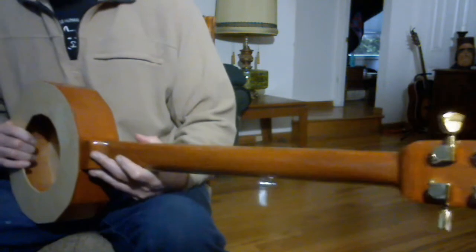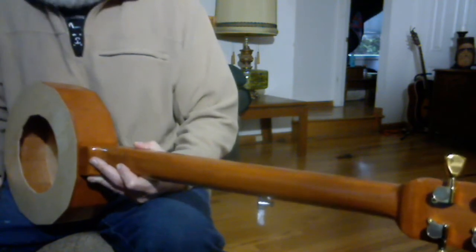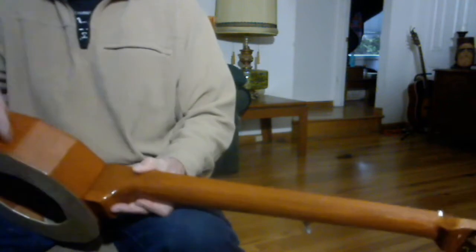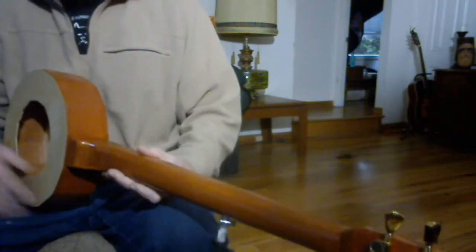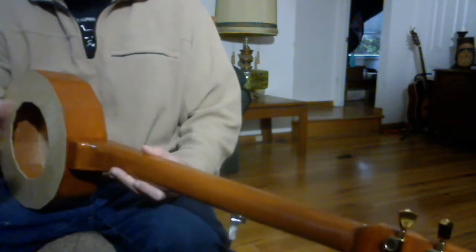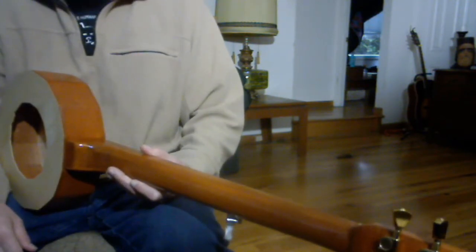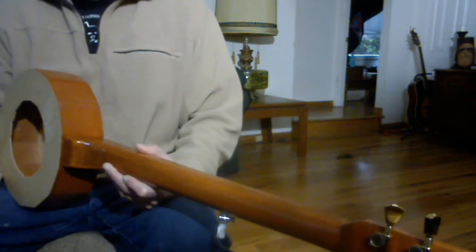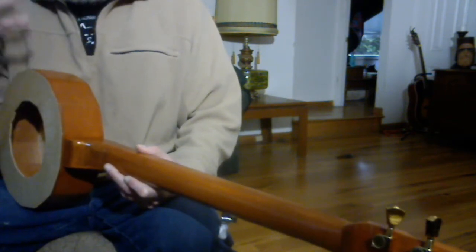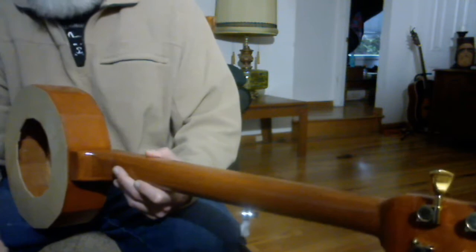I want to talk about the stain. I want to share this with woodworkers out there. Poplar wood and maple wood, which is what I think the rim is made out of, is very prone to blotching. The way most people try to prevent blotching is they put on a coat of wood conditioner or a cut coat of shellac to seal the wood so you get a more even stain. The problem is it doesn't always work, especially on poplar, maple, or pine. I think I've come up with a revolutionary technique, and I'm going to make a separate video after I do some more testing.